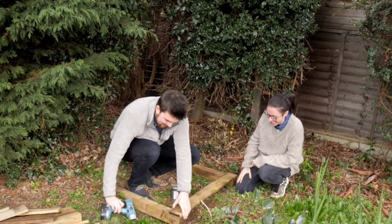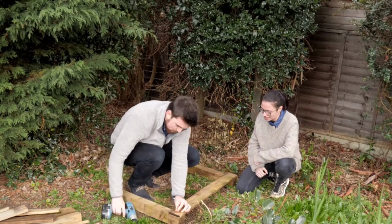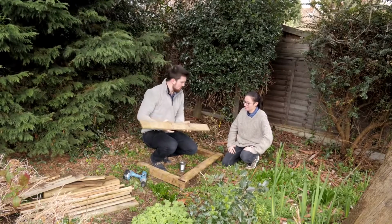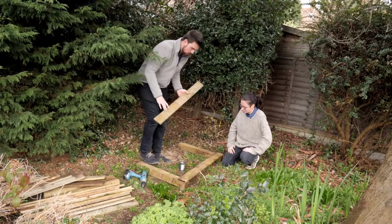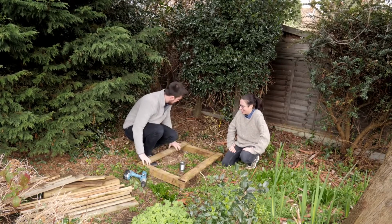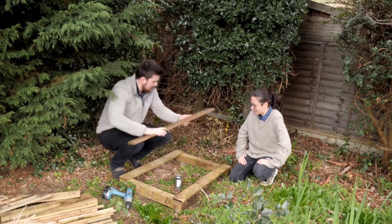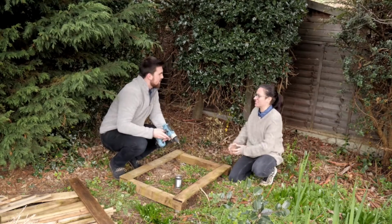So then the next thing you do is the exact same on the other side here. So I'll just do this to save you jumping over. The excitement is coming up again. Just before you make it, make sure that all of the planks fit, otherwise it won't quite match up. The easiest way, if you're into perfection a bit like I am, which can have a downside, is if I want the spacings to be accurate, I'll attach the one at the bottom and then use the planks, and then I'm free to move them about to make sure the spacing's right. I thought you were going to say you measured it and marked it out with a pencil. I haven't got time for that.